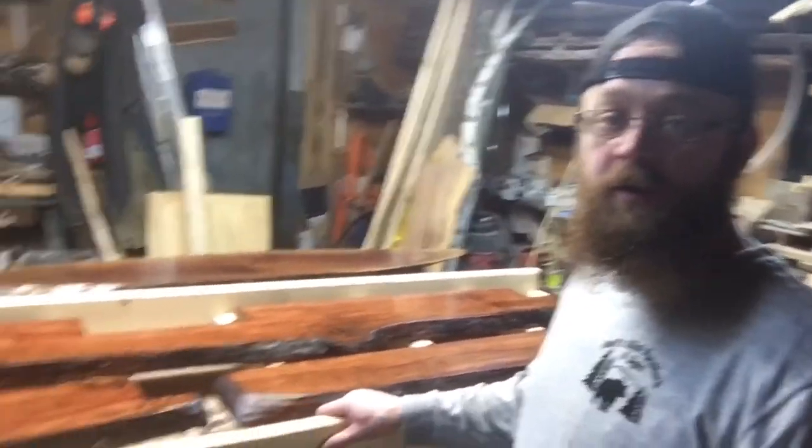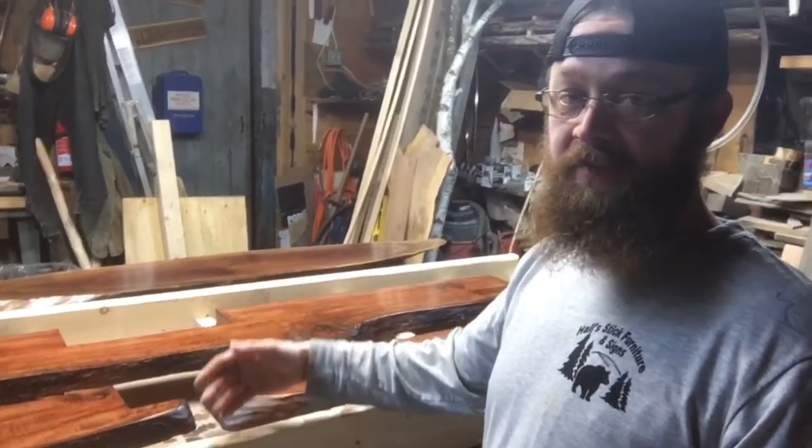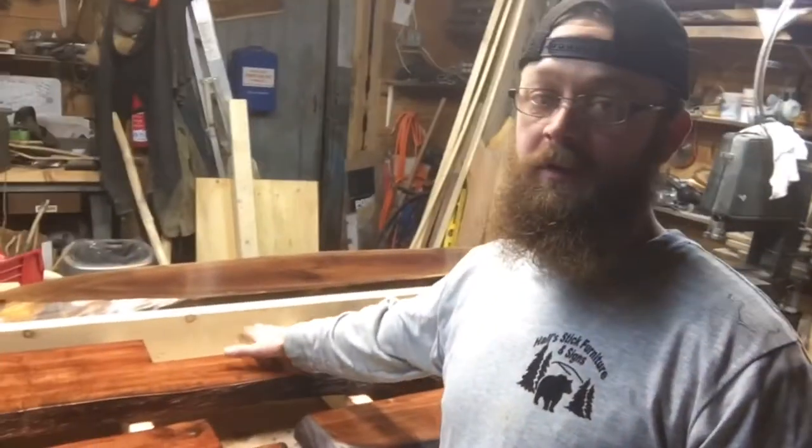About a week ago I was at this customer's home and we cut this slab in half there — this was one piece of maple — and we notched it out and made a few cuts so everything would custom fit right there on site. I wanted to make sure we had the best possible fit, so I cut it there and pre-fit it all. I ended up bringing these pieces back to my shop where I made a jig for my router, stuck them in there, and used the router to get them nice and flat and level.